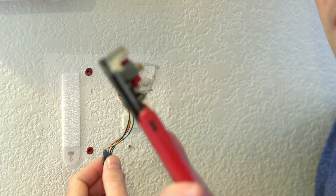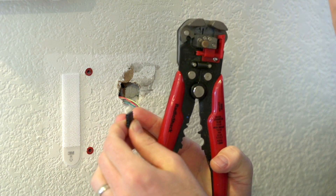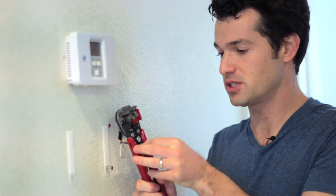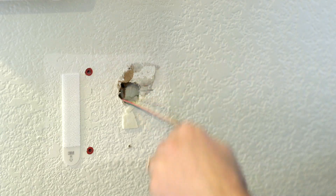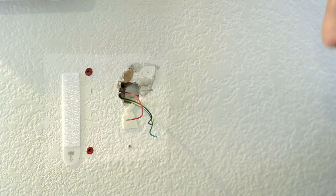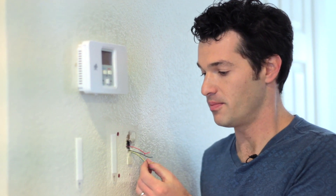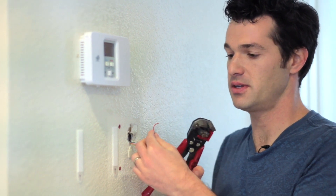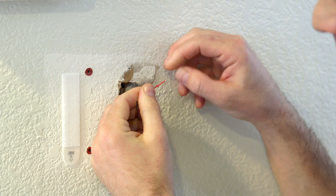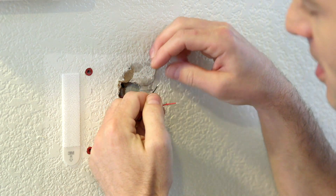Now I'm going to use my wire strippers to cut off this little harness so that we can reuse this wiring to power our charger. I'm going to cut these wires off and try not to let them fall into the wall. We're only going to need to use one pair of these wires — the red and black for the power — and the green and yellow we can use for something else later. I've stripped a little bit of the end of the wire and I'm just going to twist it a little bit. This is actually stranded wire so that the ends don't fray.